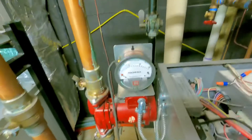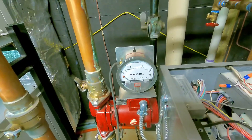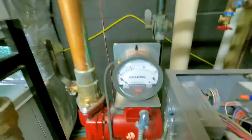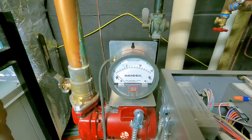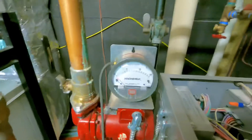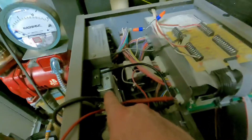The blower is going to stop, and our gas pressure is going to end up rising. You can see on my manometer — it should come up to almost zero when it's igniting. But this gas valve is not opening and allowing the gas to flow through.